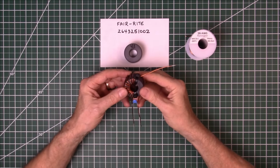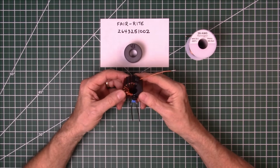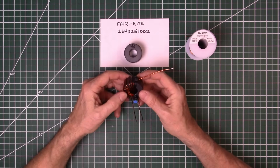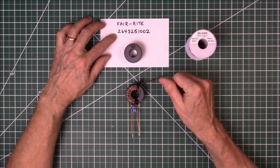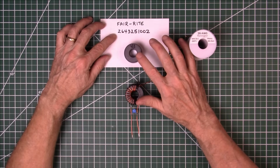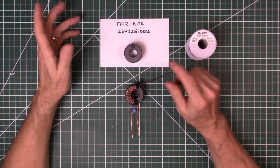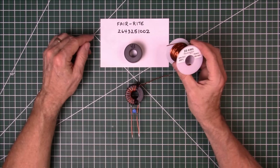We're going to go through how to build one of these more efficient toroids. You're going to have less insertion loss than any other toroid that we've discovered so far to date in the HF bands. It uses a Fair-Rite 264-325-1002 core. It's a type 43 mix. You can either write down this number yourself or use a link in the description where you can get one of these for yourself. We're going to continue to use more of the 16 gauge enameled wire to wind with.